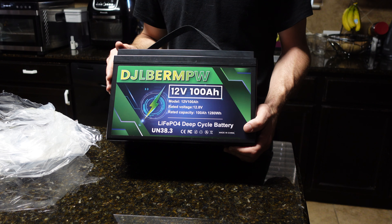For the capacity test I'm going to use a Harbor Freight Jupiter pure sine wave inverter. We'll put a 0.2C load on the battery. To measure current and capacity we're using a current meter - these are my favorite, I'm not sponsored but I use them on all my projects. They have a nice color screen and are great for monitoring power in and out. They're about $70 on Amazon but in my opinion they're the best for battery and power system builds.